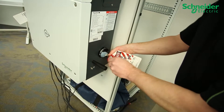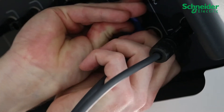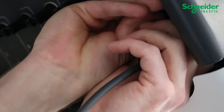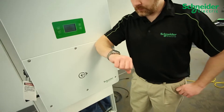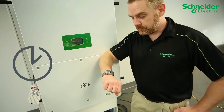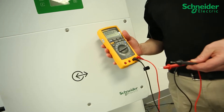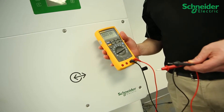Disconnect the PV string cables incoming to the inverters by disengaging all your MC4 or H4 connectors using the provided PV connector removal tool or manufacturer's recommended tool. Once all power sources are disconnected from the CL60, wait 10 minutes before removing covers. Measure for the absence of voltage using the appropriate PPE equipment and a minimally rated 1000 volts DC, 400 volts AC meter.